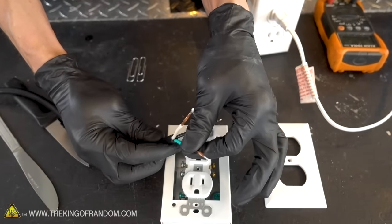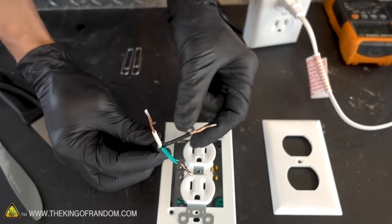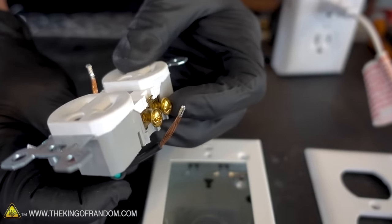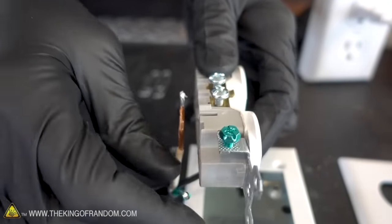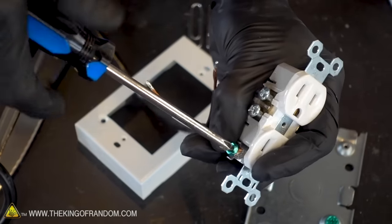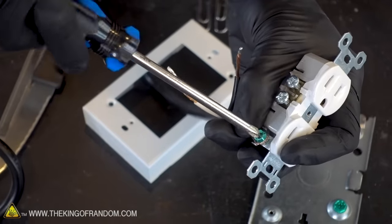In the United States, ground is either going to be bare copper or with a green covering over it. Neutral is white, and the hot wire — the one where electricity comes in — is black. Those connect onto our outlet. Usually in a US outlet, where you attach the hot wire is going to have gold screws, and where you attach the neutral wire is going to have silver screws. In this case, they've also used a green screw to show where the ground attaches. The ground is an emergency backup wire — it's in case something goes wrong. If too much electricity flows through or if something gets physically broken, the ground is there to make sure that any current flowing through the hot gets sent into the safe ground spot, because it's not going to be flowing correctly through the neutral wire.